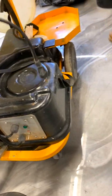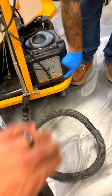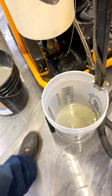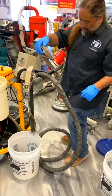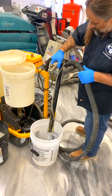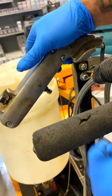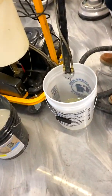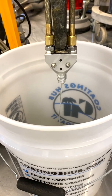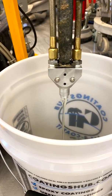To use this pump we have to plug it in to power — it plugs in right here — and then there's an on switch right here. But before you ever turn that on, you want to make sure you have this over a bucket, because if it's on it's going to start pumping. We have the speed control right here, and we also have an on/off button on the bottom side right here. You click on and then you can adjust your speed. He's going to pump the oil through, pumping everything out.